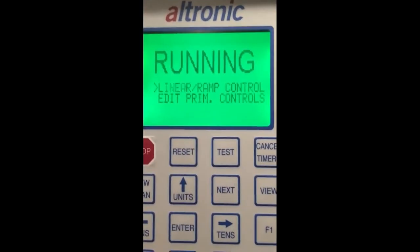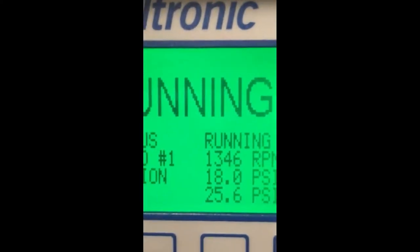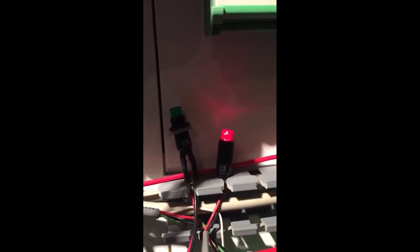So I'm going to do an example. I'm going to exit out again. Now I'm at 18 pounds and my target point was 20. I'm going to lower my suction pressure further away and stop at about 10 pounds. What you can see is the duration of the light staying on is now much greater — to where it's really trying to move fast.